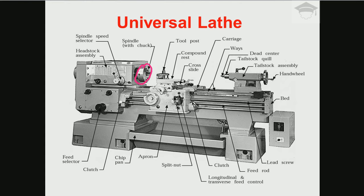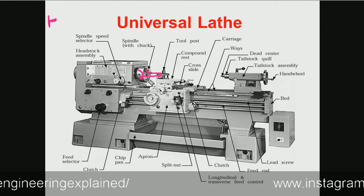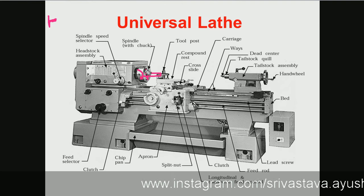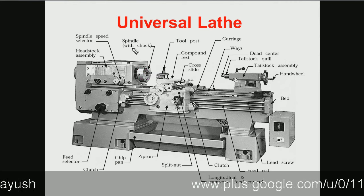On the spindle, this chuck is mounted. The chuck has three or four arms. When we open it by using a key, we turn it anti-clockwise to release the chuck, put the workpiece in, then turn the key clockwise so the arms grip the workpiece. This is the operation of mounting a workpiece on the chuck.